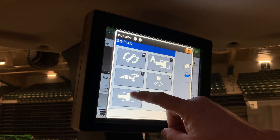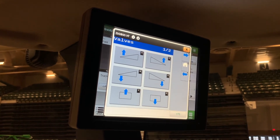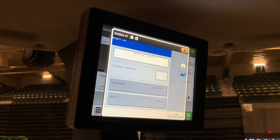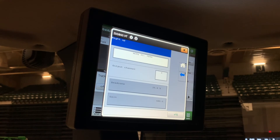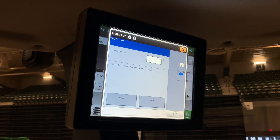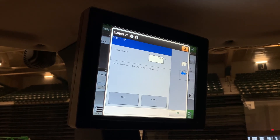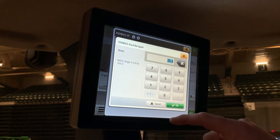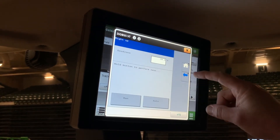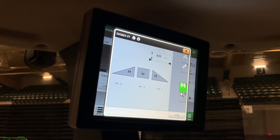The other menu is your valves. Earlier I mentioned adjusting the DZ value — that's what you want to adjust if you have a slow boom lifting up. For example on the right outer, I go into the dead zone. You can do an auto, but if you're spraying faster and want the boom to move faster, I usually do a manual adjustment — raise it up one percent at a time, test it, and keep trying until the boom comes up the way you like.